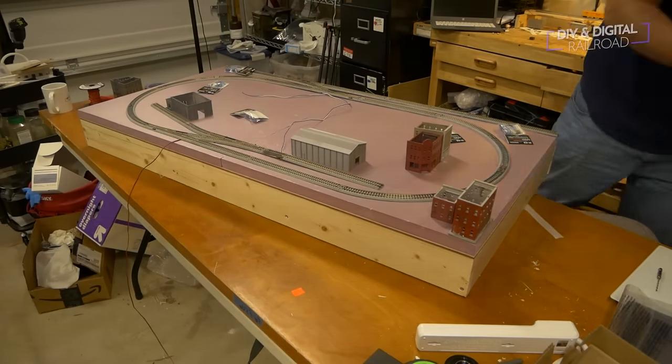If you need to learn how to program a locomotive in JMRI, here's a link to a tutorial that I did on that. All you need to do is hook up a monitor, mouse, and keyboard to the Pi and run through the programming process. If you need to hook up a programming track, simply connect the track to the B motor terminals on the DCC++ base station motor shield.